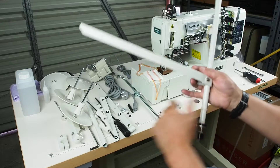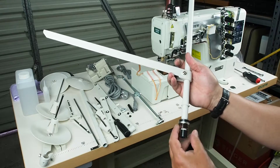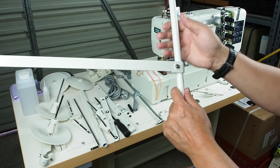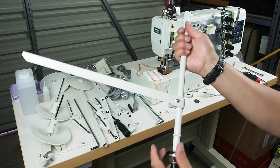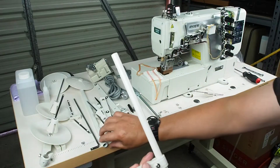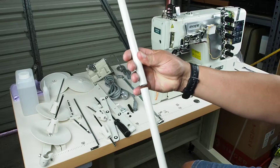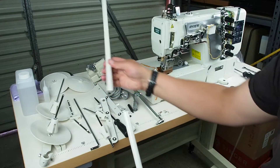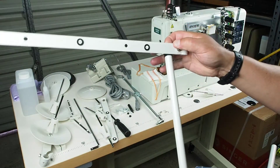As far as the thread stand is concerned, we've got this long arm here that accommodates the spool holders, and I've already attached it to the lower shaft. This part here is the part that goes through the tabletop and is bolted up. You could assemble this by installing the lower half of the shaft first and then putting all the bits and pieces on, but for ease of videoing I'll show you the assembly when it's not in the tabletop.